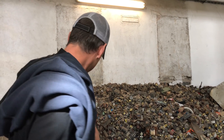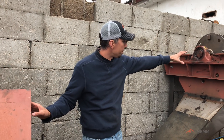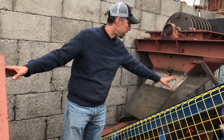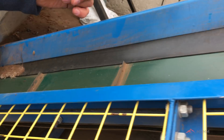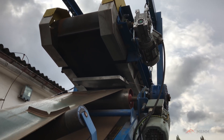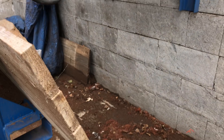About 25 tons of material here. You put the copper and steel down here and it breaks it up through like a half inch screen. And you changed this to a stainless steel chute so the magnets don't stick to it. It goes down into the conveyor belt, up under the magnetic separator, and the steel gets pulled off and over the other side of this wall. Then the clean copper falls down here where you sell it.